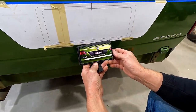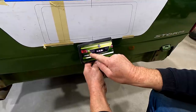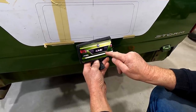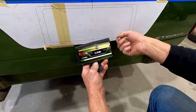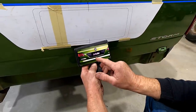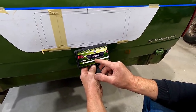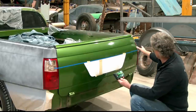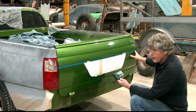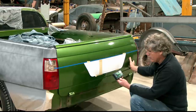So we're pretty close to what they've got there. And we've got to watch our radius around here when we make it. So we'll fold that over and we'll probably get a T-dolly in from the inside and just work that edge to get a bit of a radius around there. So I'm thinking something on a 5 or 6 mil radius on the T-dolly. We can't really do the taillight pieces into the tailgate easily for us, so we'll leave them there, and we're going to wind up with this little bit of a plain area in here.